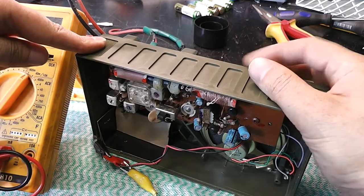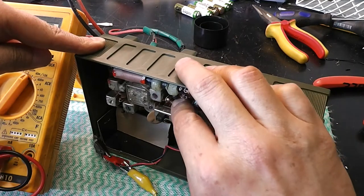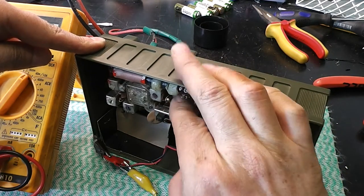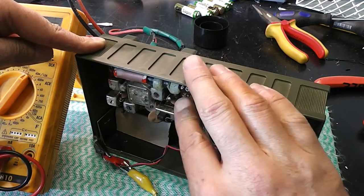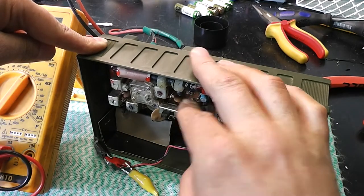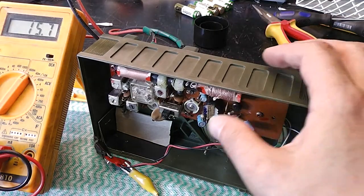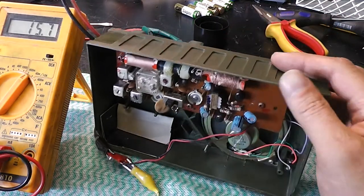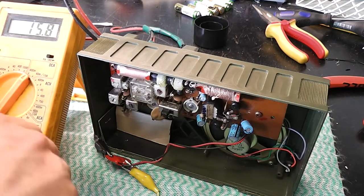Pot must be behind the board, so I can't stick my finger on that and see if I can hum. I don't mind doing that when it's running off 6 volts. Got my fingers around the driver stage. Nope. No audio. Okay. Shall I try next? Right.